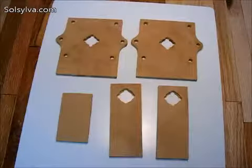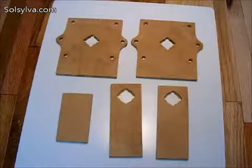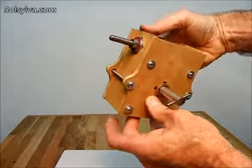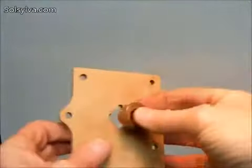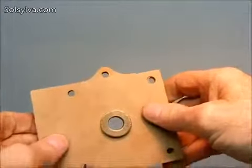The box is made of 1/4 inch hardboard. Machine screws tie it together. Its ends are adjustable so the gears can be properly aligned. 1/2 inch bore flanged sleeve bearings pressed into the sides hold the driven gear's axle bolt or rod.